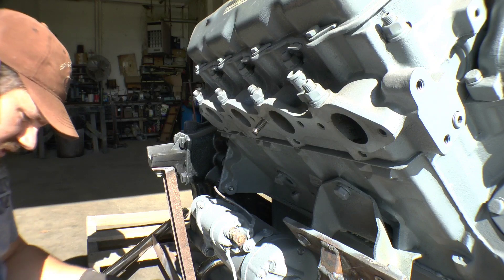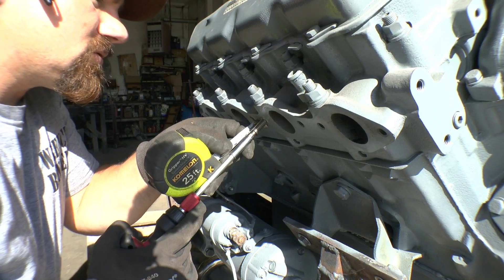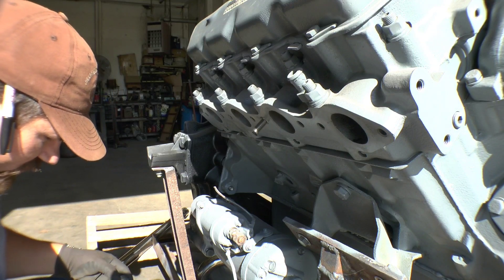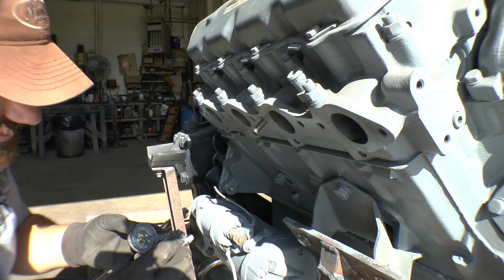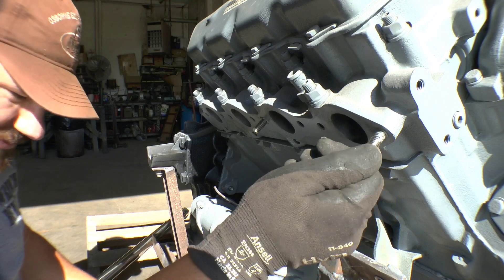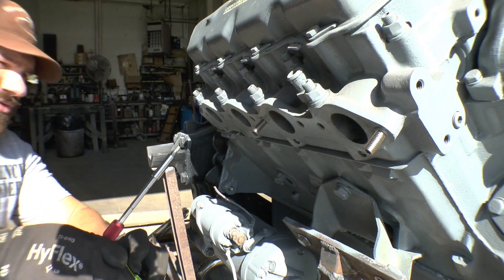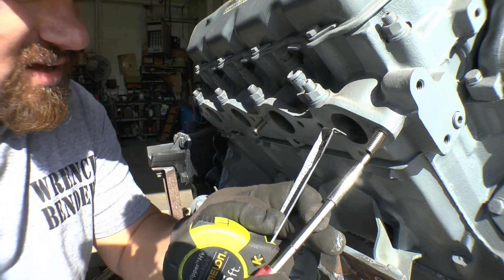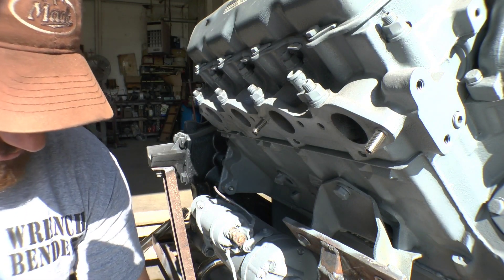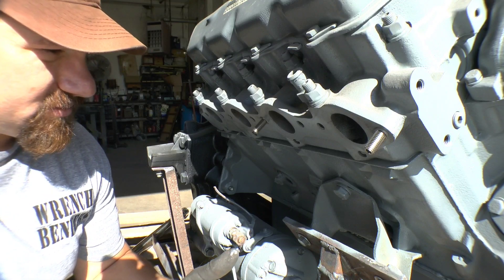And there we hit the mangled thread right there. I'm going to take it a little bit more because I know what I want my overall length to be — and that's right there, that's what I want. I'll do another one, going all the way across. I'm also making sure I put the anti-seize on the end that does not have the Allen head, because I need the Allen head to tighten it up. Now I'm going to measure that again — I need to take that one a little bit more. That's pretty close. I've got six more of these to do, and then I'll show you the next thing I've done, which not everybody has to do but it seems to help out.